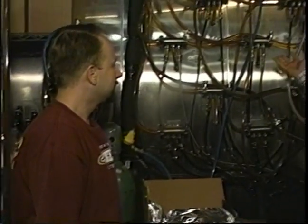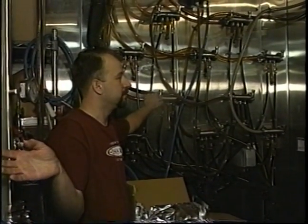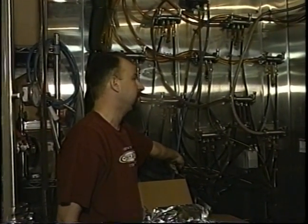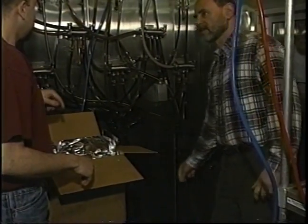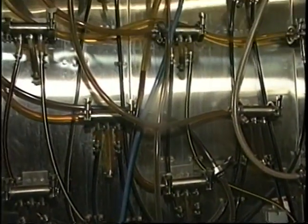And what is this Rube Goldberg-like assemblage on the wall? These are called manifolds, and what these will do is the beer will leave the serving tank and then at the bar, we have two sets of faucets. So this is the line from the serving tank, and then it splits to each line, each tower at the bar. And these big pipes, this is just insulation, isn't it? Yeah, this would be a beer line chiller, so that the beer is wrapped in a glycol chilled line so that it won't get warm on its way to the bar. Great, you thought of everything. Absolutely.